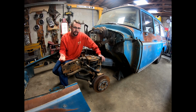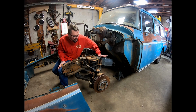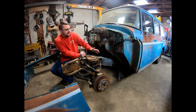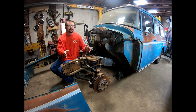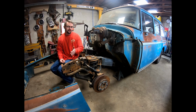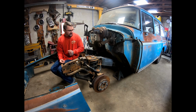And when you're trying to get really close and you keep throwing yourself off a 16th or an 8th there, it was driving me crazy. I was getting pretty frustrated. So after I got those clamped up, I finally got it squared up in the frame enough where I was confident. I had a matching wheelbase actually, though the wheelbase was still an inch too long and I wasn't sure why. Then I trimmed the frame again until I got the wheelbase where it needed to be,